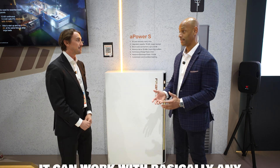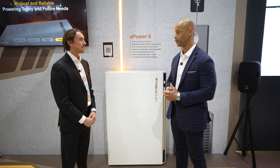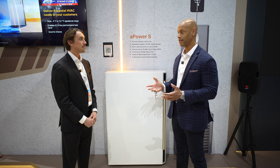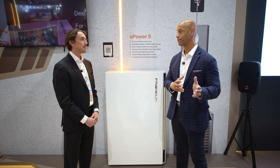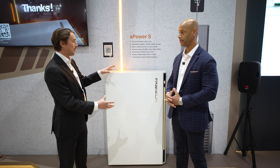That's huge. Franklin is a great choice for AC coupling on retrofit storage — if you already have solar panels on your roof, you don't want to rewire the roof. You can tap in your battery AC coupled at ground level without invalidating the warranty of whatever's already on the rooftop. But for new installs, this is going to be a lot faster for solar installers if they can wire high voltage strings on the rooftop, not worry about module level power electronics or a separate grid tie inverter, and just control everything here. It's really all in one in this enclosure.